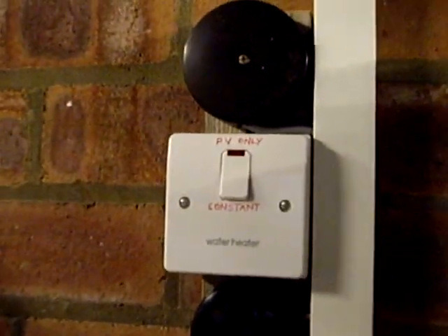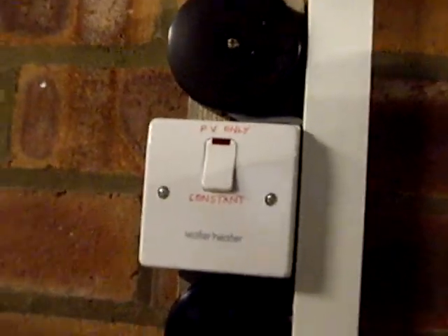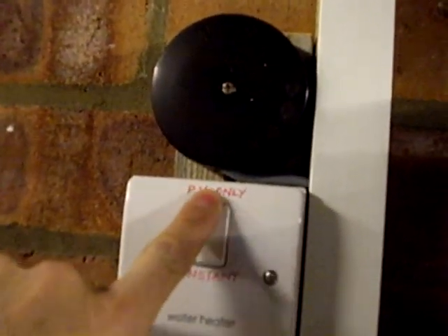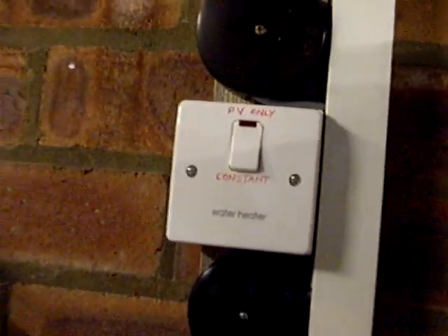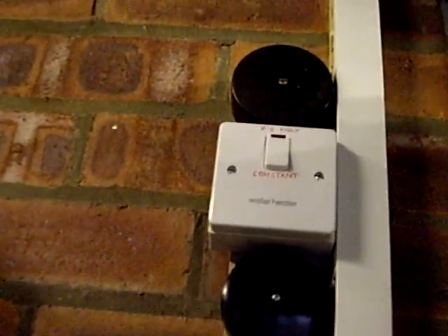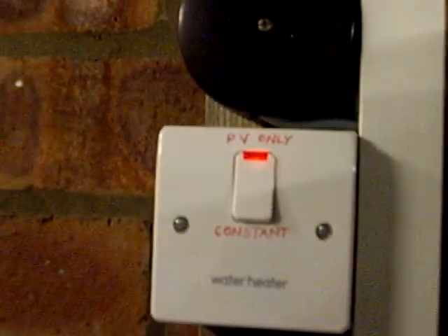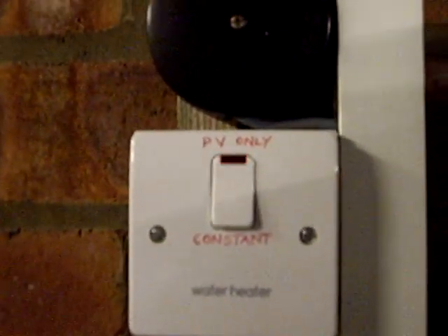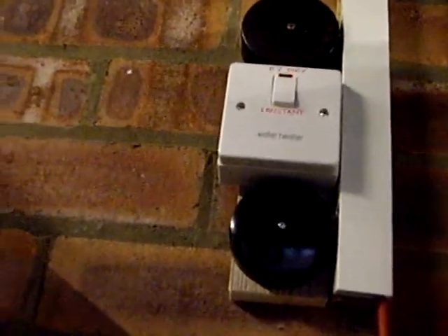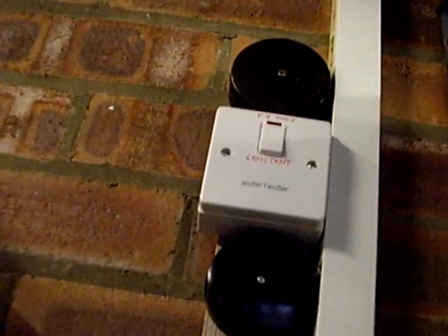Anyway, that's all plugged in and live. My heater is plugged in but not on. At the moment we're not generating any surplus power. To simulate some PV, I switch on the space heater at something like 750 watts and we should start flicking — there we go. The delay was the energy bucket charging up. If I switch my simulated surplus PV off, that should stop flicking immediately — and it's gone off.